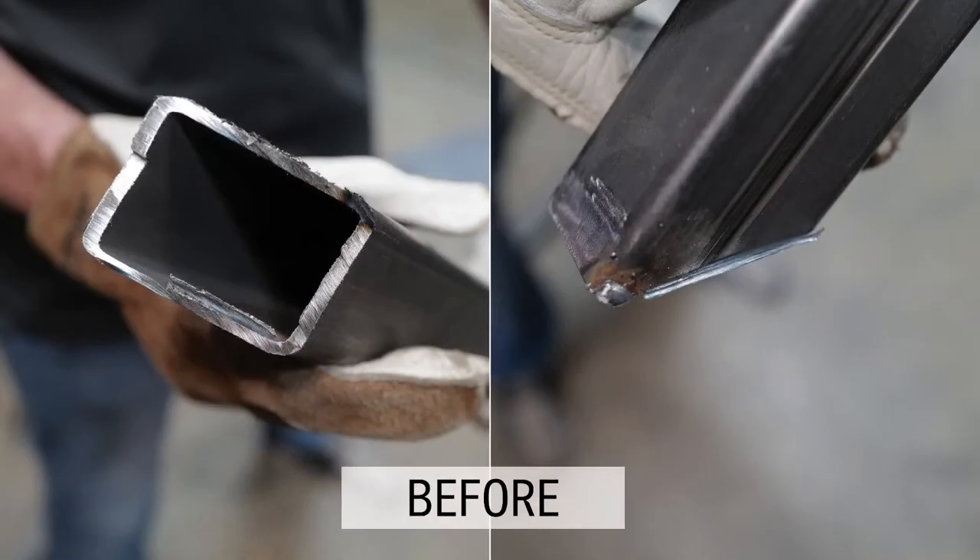When it comes to burr removal, the big thing to remember is you don't want to go too low in grit. Your whole goal is just to remove the burr — you really don't want to remove any of the metal. If you're trying to make pieces fit together and you remove too much metal, it's not going to fit right. For the grit range: on the low end, you could be at 60 grit; on the high end, about 120 grit. For non-ferrous metals, use that 120 grit — it won't remove as much metal, but it'll deburr and clean it up. For carbon steel or stainless steel, you can hit that 60 to 80 grit. A lot depends on pressure too — don't jam it in; barely put it up to the material, let it get those burrs off, and leave it looking clean.